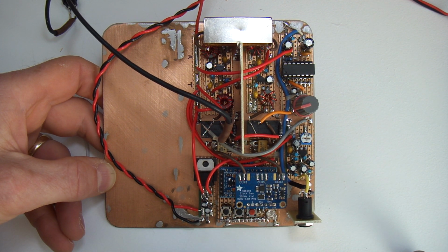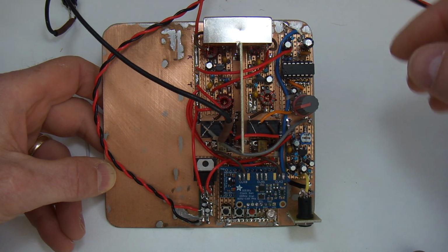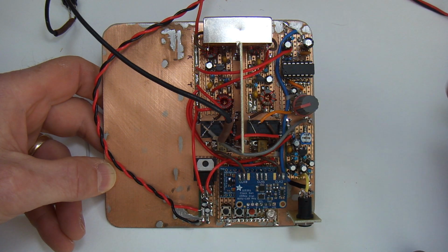So just, again, we go through the mode. We're now transmitting an N, so dialed it, for the North Island mountain radio service. Then if I just push it again, it then defaults to the south, so S, and then I can go back to normal. So just a longish heartbeat for normal 3690 kilohertz for the QRP frequency.